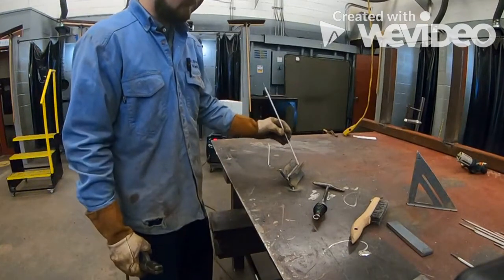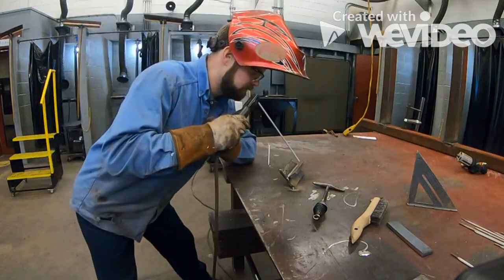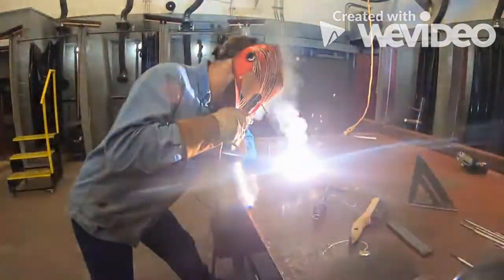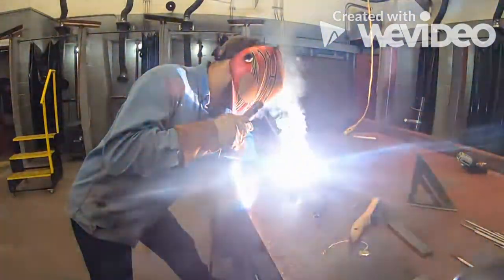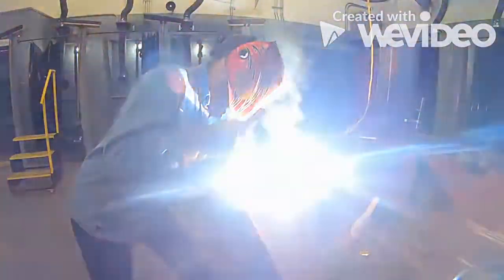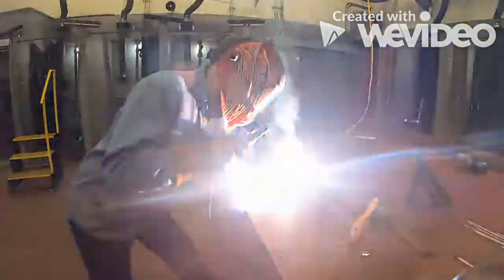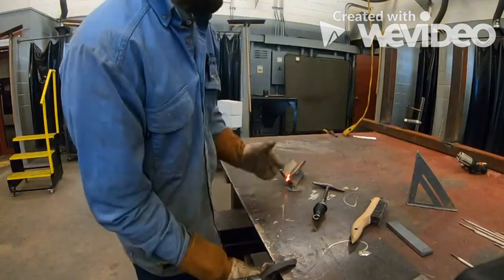So our next weld, we're going to drop this about 30 degrees or so and perform a weld right on that right side. Okay. Now you can just set up like this. Make sure you're only taking half of that previous weld away. Here we go. And you can go a little bit faster for this second weld. Then when you get to your edge here, make sure that you're wrapping around this joint. Don't stop directly on the end, you want to keep going, okay?